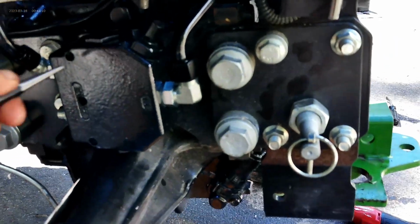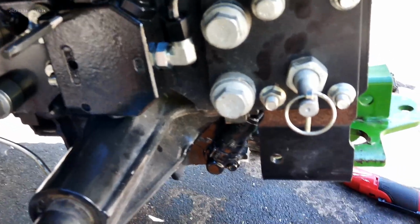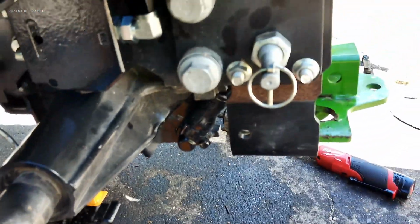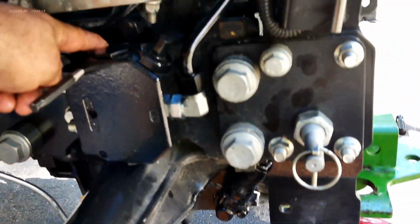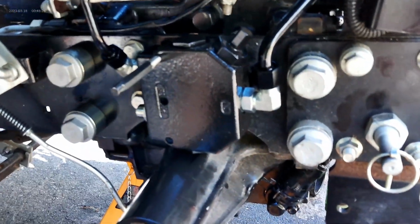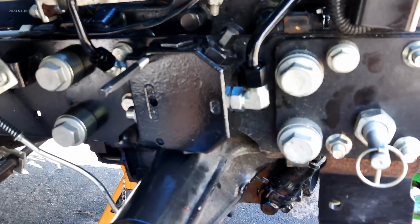We took a center punch and punched the holes here and here. The third one's an extra, and it's going to be too low anyway. But if you don't drop this a little, it's too close to the top of the frame, and you're not going to be able to get a good hole and drill it out. So next we'll drill it, and then we'll tap it.